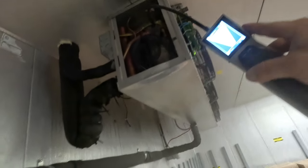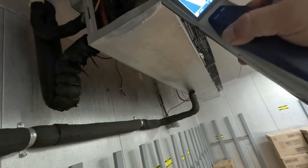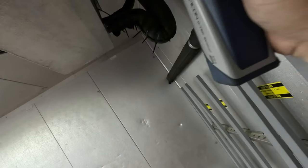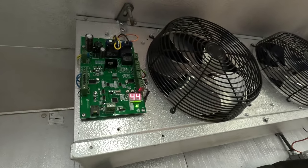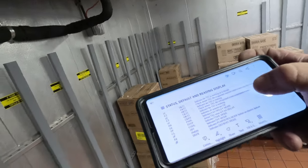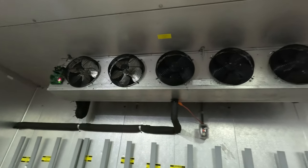We're at 77 degrees. Let's give a sniff up in here for leaks. We need to read about the termination temperature. You won't have a hard time picking up a leak in here given it's hot gas. We're running high pressure. It's possible I accidentally reset the board when I hit some buttons not knowing what I was doing. We need to recheck some settings. Right now it's showing CD — coil drain mode — so it's draining down. Why wouldn't they just put the sticker in the panel?